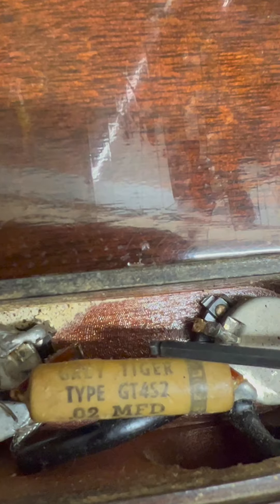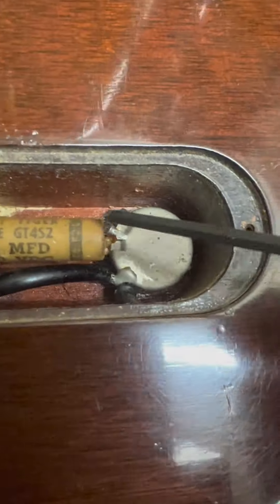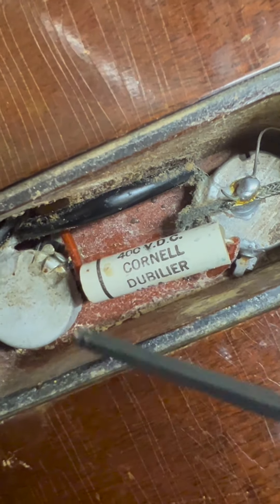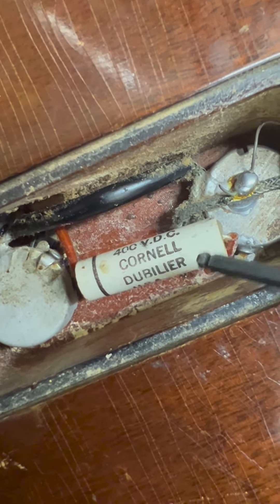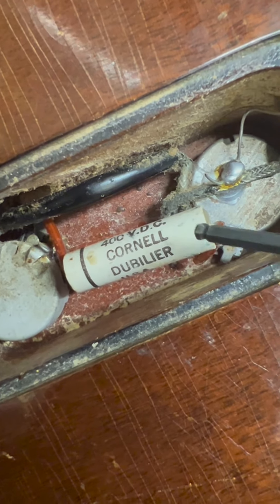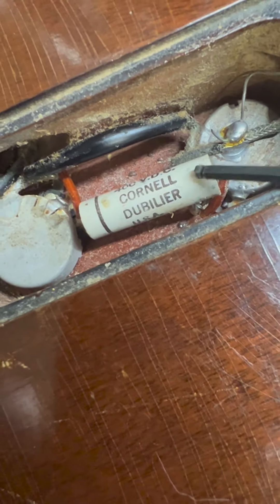This is a gray tiger filter cap, and it has a wax on the outside. Then it has these red sleeves on the side to keep it grounded. This guitar has these red sleeves — that's an indication of originality — but it has this Cornell cap on it. This filter cap is filtering out high end, and you can roll off the high end and be left with some bassier, warmer tones. But this is a cap you'd normally find on amplifiers, and it confuses a lot of people.